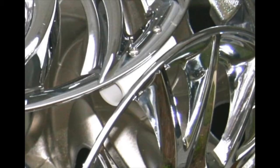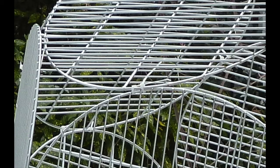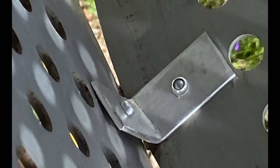The most challenging aspect of making these balls is how to connect the pieces together. I use a variety of techniques depending on what I plan to connect. In this video, I will use a simple piece of PVC pipe and sheet metal screws for the connectors. Depending on the materials, I have used a number of other types of connectors, such as machine screws and nuts on balls made from plant trays, zip ties on a ball made from grills. But most often, I use small pieces of bent aluminum strip combined with pop rivets.